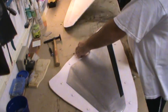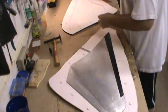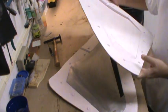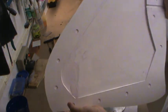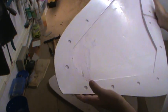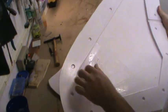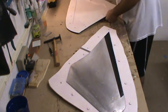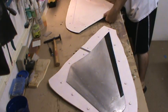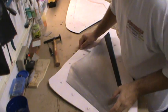You can see there's the bottom mold half — it turned out really well. You can see where the wax was really built up in the panel lines. I'll just take a red or white Scotch-Brite pad and go through there, clean all the PVA off, and it'll actually clean all the dark wax spots off as well. That one turned out extremely well. Now let's see if we can get the stab out of this thing.